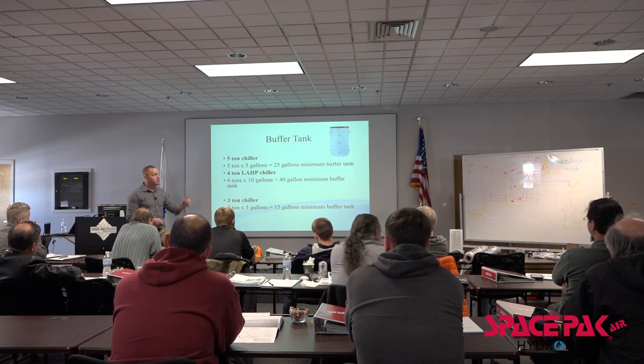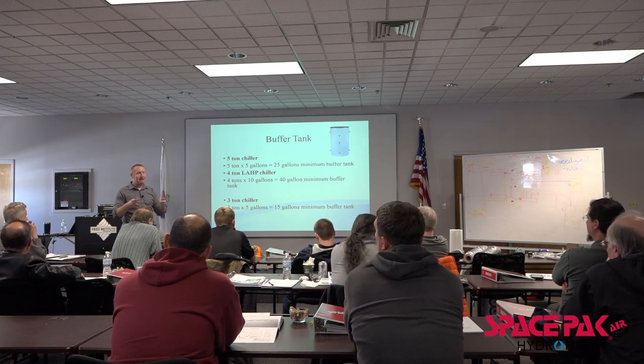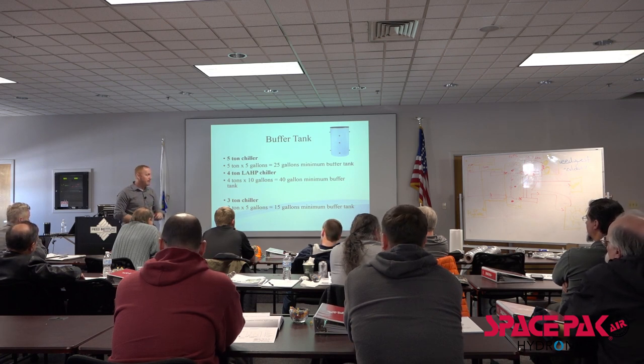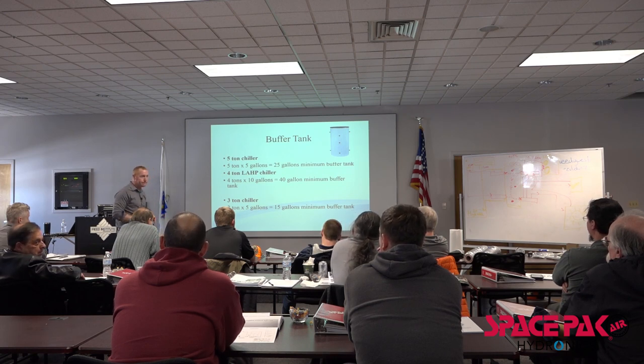You've got to think, if we've got some of these zones that are small zones, and we've got 80 gallons of warm water sitting there ready to go that we built efficiently, you may satisfy a zone or two and never even call on your heating, the outside unit, our heat pump.